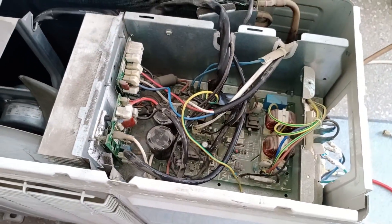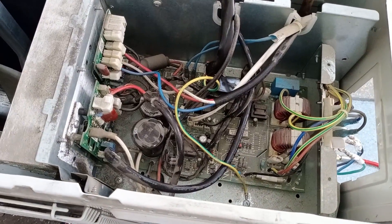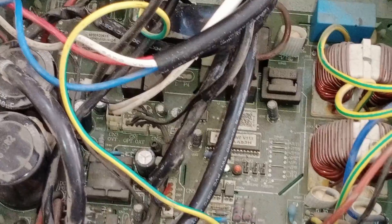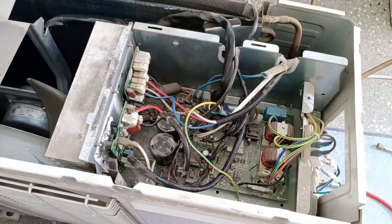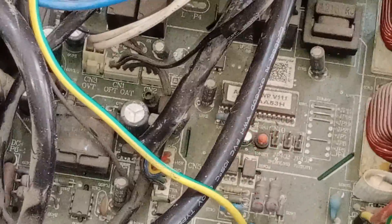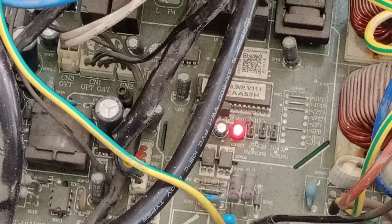Let's understand what the problem is with this unit. The P6 error means that the unit is overheating in cool mode. But the outdoor 5 blinks on the circuit board are telling me that it has stopped the unit due to protection from overheating, and I am trying to cool it down — meaning the compressor, the circuit board, and the fan blower motor are all heating up. According to the P6 error, the outdoor should blink 6 times, but it is blinking 5 times.